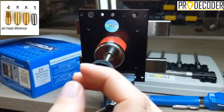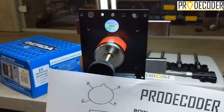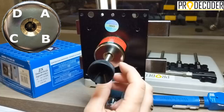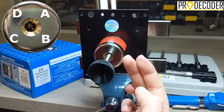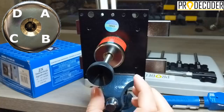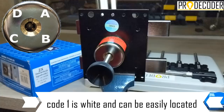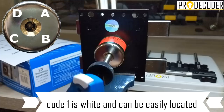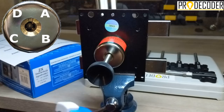The point here is to try and locate code 1 in the four rings. As you can see on the diagram here, I have ring 1, ring 2, ring 3 and ring 4, and these are the positions. Now every pin is put away. I will pull out just a little bit until I release the pins from ring 1. Listen now. I hope you heard that. The pins from ring 1 are now released. Which means that if I go with the flashlight through the tube and take a look from the inside, I will be able to see the four pins — one, two, three, four.